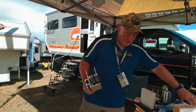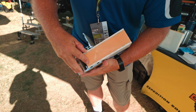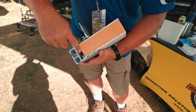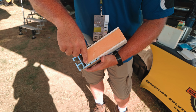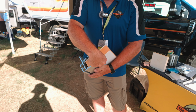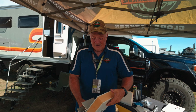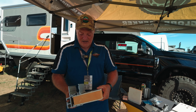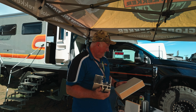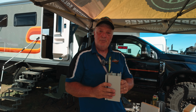So when you put a panel into this, you put a bead of caulk here, and when this panel goes in, you have 1, 2, and there's a little glue pocket right here for any excess, 3, 4, 5, 6 seals to seal this environment. And then you do a finish caulking on the outside, finish caulking on the inside, for a total of 8 seals. So the odds of this leaking are extremely low. If you can get water past 8 seals, well, you probably did something wrong when you're doing your caulking. So it makes for a very robust, very thermally efficient, and waterproof environment.